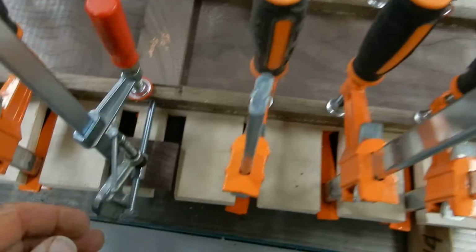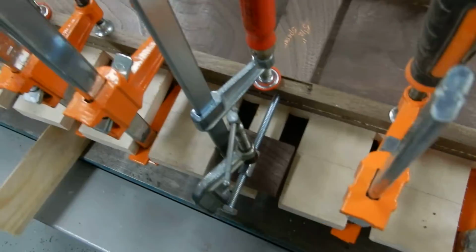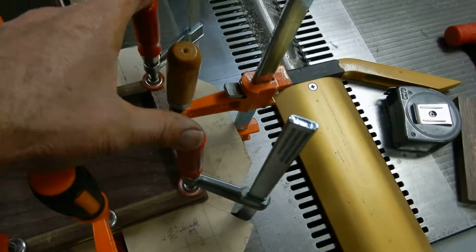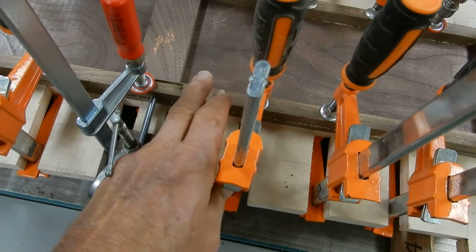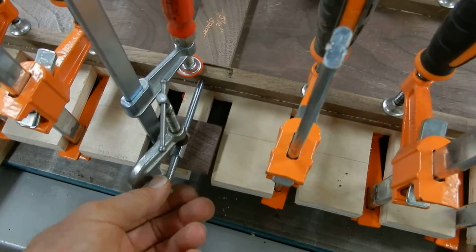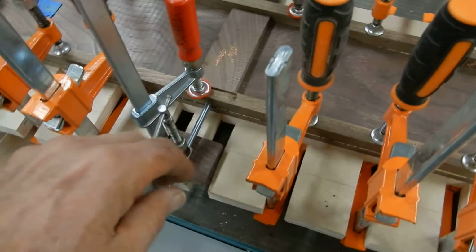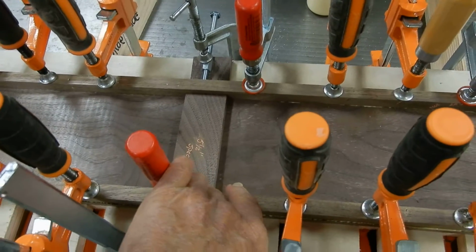So I know the ends of the box are the correct width and will line up with the companion bottom walls. My cure for coming in with pressure: I start out by securing all four corners with these smaller clamps. That nails it down once I've applied glue to the walls, and here's the lid right here. Then I bring the sides in for the back side and the front side where the key lock is, and measure that with this spacer, which can be slid down from center position to either end.